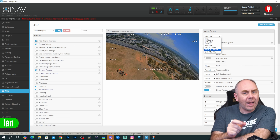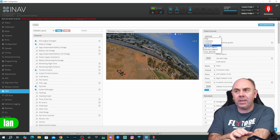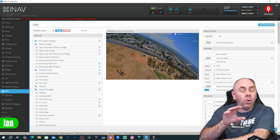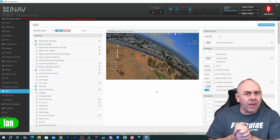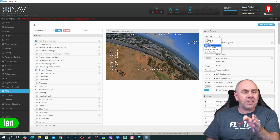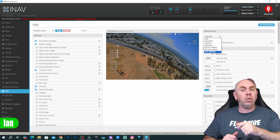DJI HD compatibility mode is the old mode that made the iNav OSD work with the old DJI system, but as you now have the full custom OSD you want to use Avatar or alternatively DJI Native. Once you've set that, you can start configuring your OSD options just like you would when using FPV WTF or any of the other systems. This should work with pretty much all recent versions of iNav. I'm demonstrating it here on version 8.01 on the configurator, which added the new DJI Native option. If you're on an earlier version you won't have that option — just select Avatar instead. The safe bet is choosing Avatar if you're not sure.